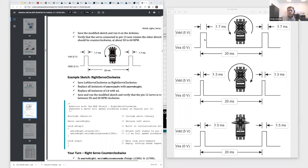And that is normally something that you'd use to control a motor or to control LED brightness. But with a hobby servo, it still works as it comes from the Arduino, but it also works as it comes from the Basic Stamp, because the hobby servo is really only concerned with the amount of time the pulses stay high. Does that make sense?